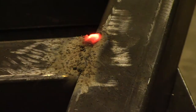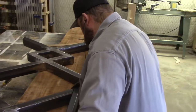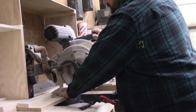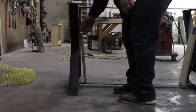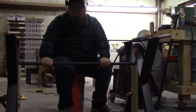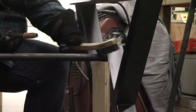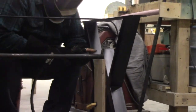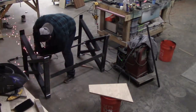I still have a lot of grinding to do because those flux-core welds are just ugly — lots of spatter everywhere. You can clean it off and see the weld is okay, but the spatter is just everywhere. At this point I had welded and painted the base and liked it, but it needed more lateral support. Those two round pipes gave it the lateral support it needed. I was concerned they would take away from the design, but it actually looks great.